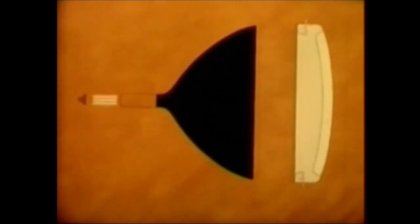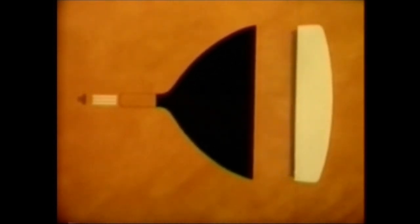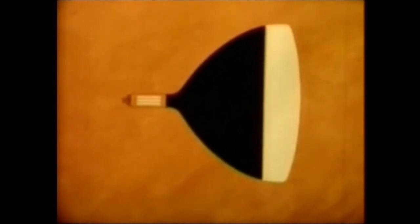The most important parts of this tube are the three-gun assembly, the neck with its cone, the faceplate with its shadow mask, and the metal rim band. The shadow mask fits inside the faceplate, which is coated with a fluorescent screen.